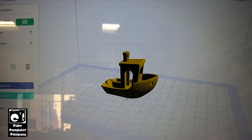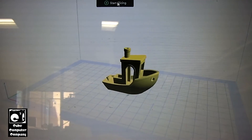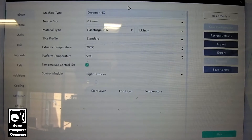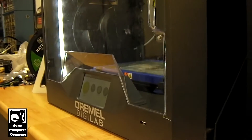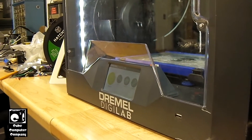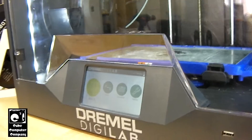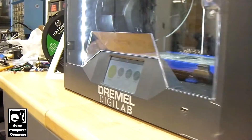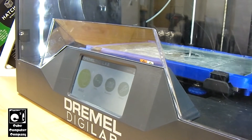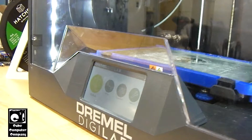We're going to clear supports here — I did want to touch on supports a little bit. We're going to start slicing. I should note that the Dremel Digilab 3D45, by default, stores the information for the filament type on board and ignores what is in your G-code. I do believe you can override that in the settings on the menu, but we're going to assume it is overriding the G-code settings and using what it has on board.